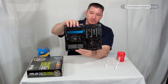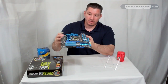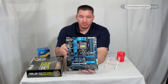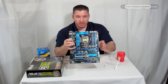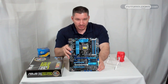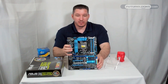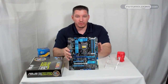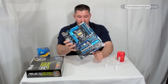On the back you can see they're using plates to help hold on some of these heatsinks, which is a good move since they might otherwise rock. Under here they have their chokes. This board also features the Digi VRM, which is a great feature — essentially dual processors that help control and manage the voltage going to and from the processor. What you get out of that is faster sensing and response, better component cooling, because the new dual driver MOSFETs alternate underneath and don't have to heat up doing the job full time. That means twice the power for higher load extremes and better transient response, so you'll keep that higher overclock a lot more easily.